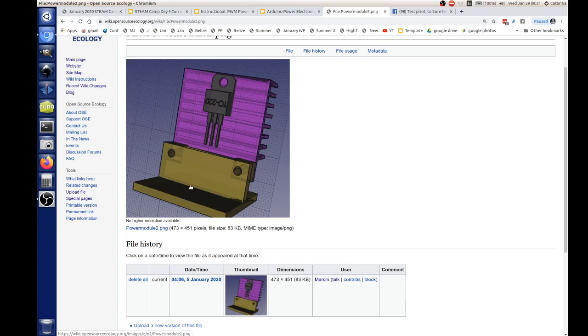One of them per kilowatt, but it really depends on how big the power elements are. You can make them bigger, so each one of these elements could, in principle, handle a couple of kilowatts. Probably that'll be practical, because how much heat dissipation can you get from a fan and one of those heat sinks? I think it's probably going to be at least 40 watts, because we cool our extruder. The extruder, for example, is 40 watts. Yes. And we know that when it's just at heat and you have the fan blowing, the thing keeps very cool, you can touch it and there's no problem. So we know that we have at least 40 watts before it starts getting hot to the touch.